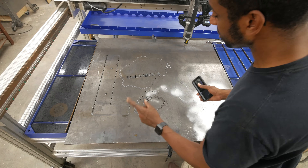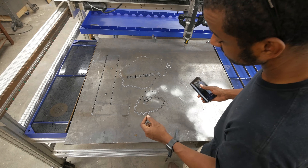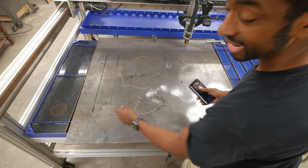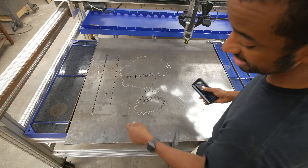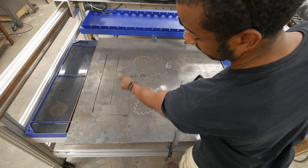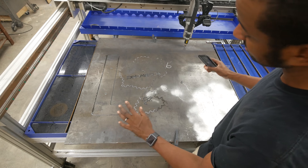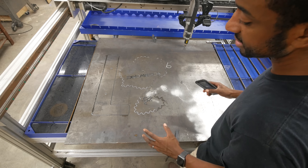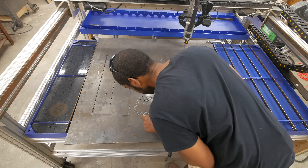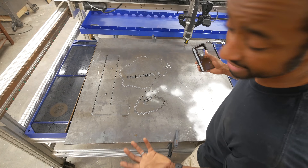There's definitely a learning curve here. Right now I've got it set at 45 amps and I was doing about 35 inches per minute. When I got to a certain point I thought I'd try slowing it down from 35 to about 20 inches per minute, and the cut got a lot better. So I'm going to let it run the whole thing one more time at 20 inches per minute, even though I'll be retracing the same areas, and see if it cleans up these cuts — because it looks like it didn't quite go all the way through in this area here.